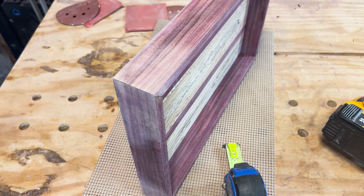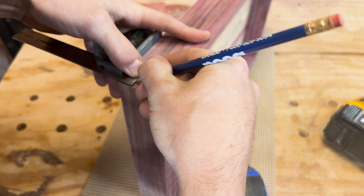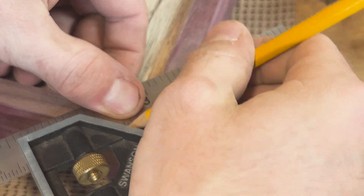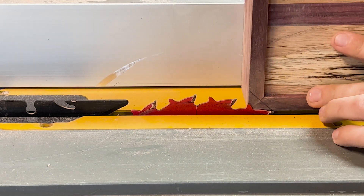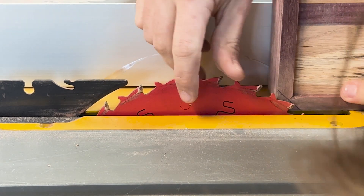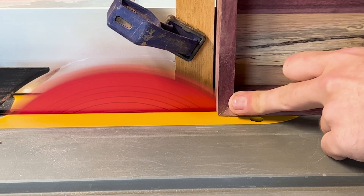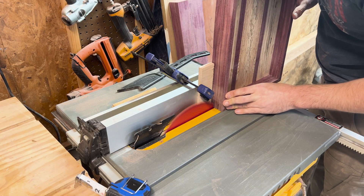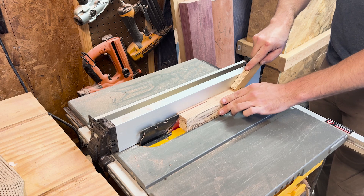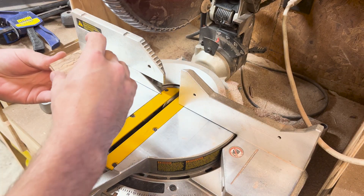I need to strengthen the corners, as the glued face of mitered edges isn't that strong and is liable to break or shift over time. So I decide to add splines to the mitered edges. I make two lines on each corner face where I want them to go, then scribe a line on the corner using a tri-square to set my depth. Over at the table saw I set the blade height by eyeballing it, making sure the blade edge contacts both the top and bottom of my line for a straight even cut. I add a stop block so I don't cut through the corners, and cut two splines into each corner all around the piece. I then rip a couple pieces of spalted maple for the splines, cut them to size, glue them into the corners, and use a dead blow hammer to coax any that need a little caressing — but they all fit in pretty well.